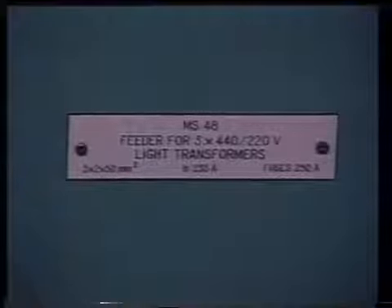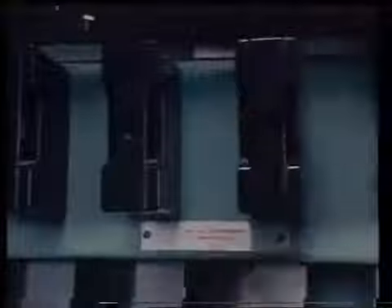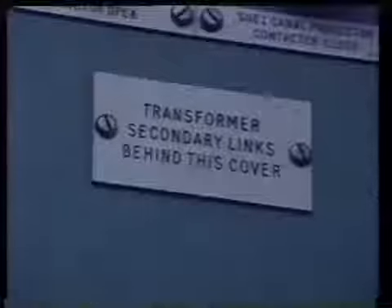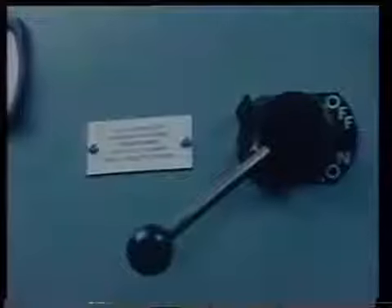We begin with the lighting system on board ship. The lighting circuit is usually 220 volt or 110 volt AC supply, provided by a set of step-down transformers connected in delta-delta. On the rare occasion when one of the three single-phase transformer units may develop a fault, it can be disconnected by first removing the primary fuses, then removing the secondary links of the phase affected. The transformers will still provide 220 or 110 volts, but at a reduced power, at about 60% of rated output. This state is called the open-delta connection.